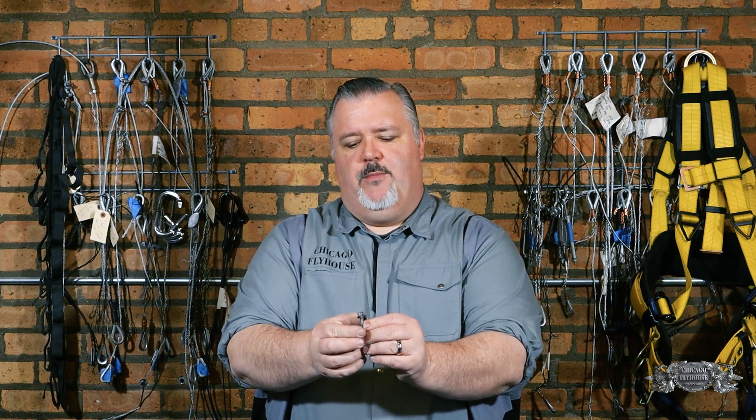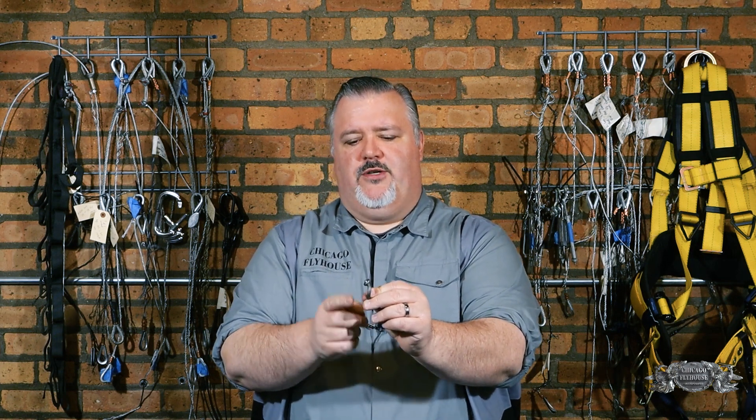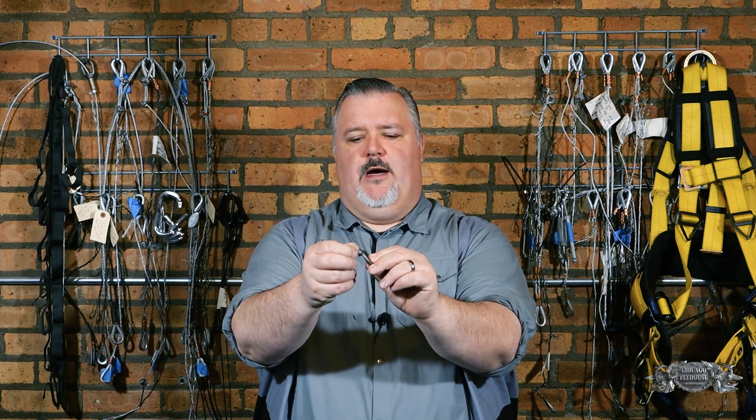As we can see from those tests, we got results that are pretty much in line with what we expected, although we did find that with this shouldered eye bolt, when we pulled on it in what should have been the weak direction — it goes like that — it folded quite a ways before it broke. So we actually got more strength out of this than we expected. On the other hand, when we pulled on this one, the one we broke by pulling on it this way, it snapped off sooner than we expected. If we take a look at the bent wires, we see some interesting sculpture — their strength was very, very low, nothing compared to what we saw with the forged eyes.